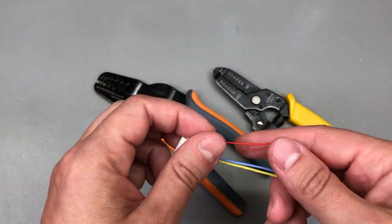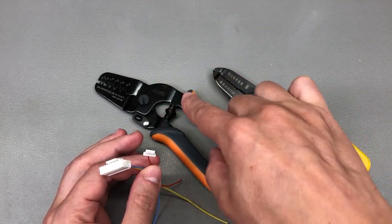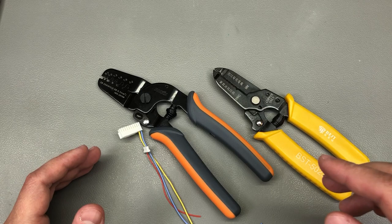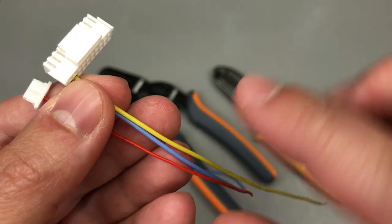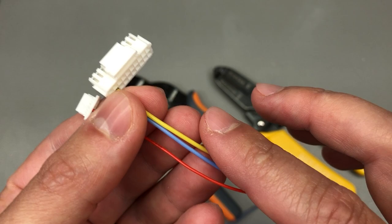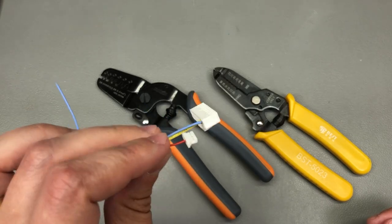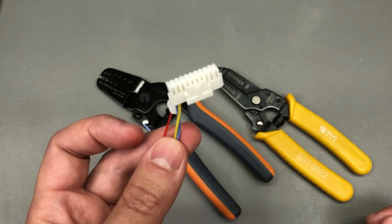I can share a few tips to help you get better crimps. First, always pick the correct size on the tool for the crimp you're using — use the instructions on the packaging. Second, always use a wire size that fits the crimp. Pay attention to insulation thickness: these two wires are both AWG30 but there is a massive difference in thickness due to different insulation, so they won't fit the same die slot or even the same crimp size. Third, practice until you get it right — there's a combination of factors like wire stripping length, how far you insert the wire, and crimping pressure that all need to be dialed in.